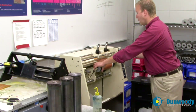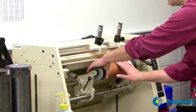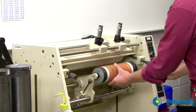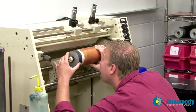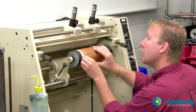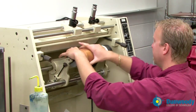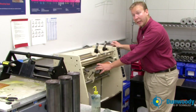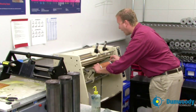Now that the plate has been attached to the plate cylinder, put the plate clamp up by pressing the plate clamp up toggle. Lightly put pressure on with your middle finger and rotate the cylinder. Make sure the plate is lined up by looking at the registration marks on the bearer bar — they should line up. If they do not, determine which way the plate needs to be moved, pull the plate back carefully, and tug it over to one side. It is very important that the plates are mounted perfectly — if they are not, you will have nothing but trouble on press. Remove any excess sticky back, leaving about a half inch on each side of the plate.